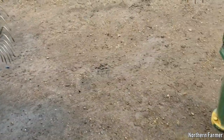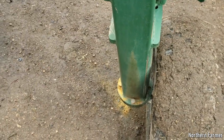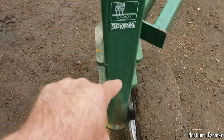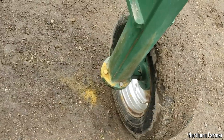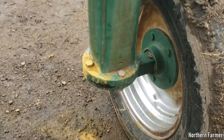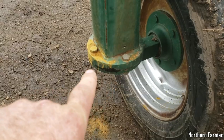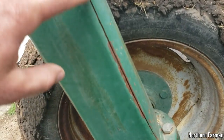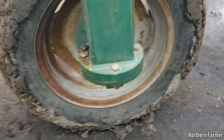Another thing I didn't notice when I bought it was these square beams here — post square tubing — they were swelled up. That's because water probably got inside there around this pin here. Water gets in, goes down there and freezes, and we all know what happens to water when it freezes — it'll bust anything. This side didn't break but it sure got swollen, as you can see. So I got Sean to drill a weep hole, which I had to do on my sawmill too. Sean drilled this one and the water just came pouring out. This one wasn't so lucky — it actually split right here. So it did split open, and I'm going to weld that back up. Sean drilled another weep hole there.